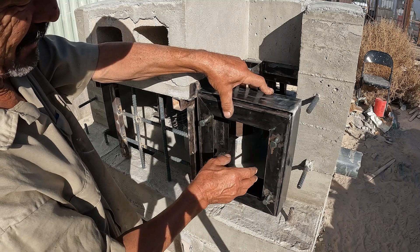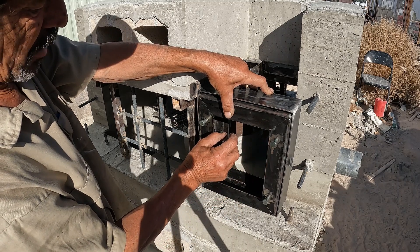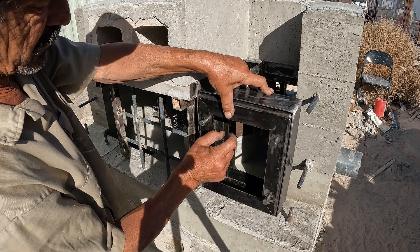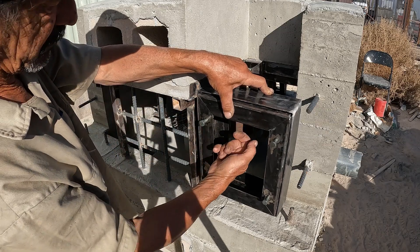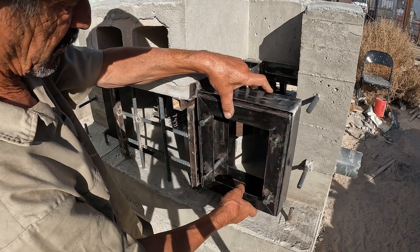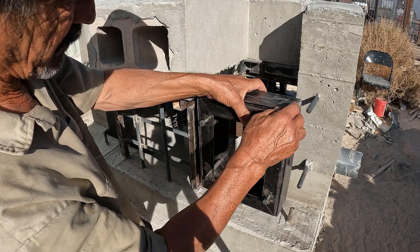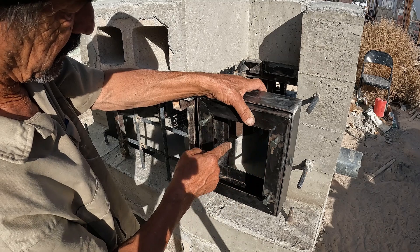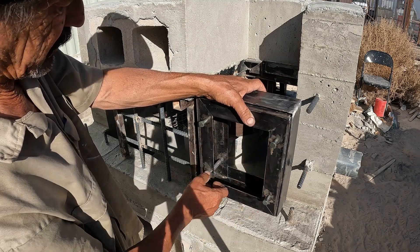This is going to be filled with concrete, and I'm going to have probably some fiberglass sleeves if I can get them in here on time — going through the concrete, the wires will come through the sleeves. Either that, I'll just leave a hole through the concrete. I can mount the frame without this door and get this sleeve in here later, in a couple days. That way I can get this concrete poured.